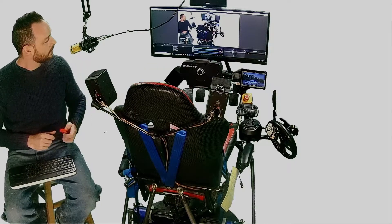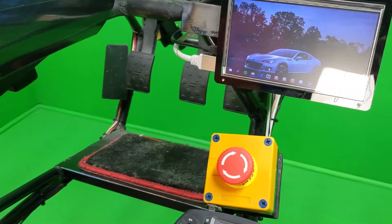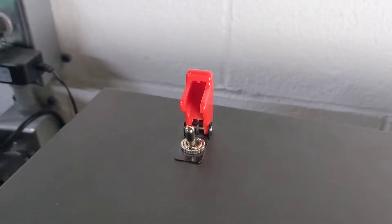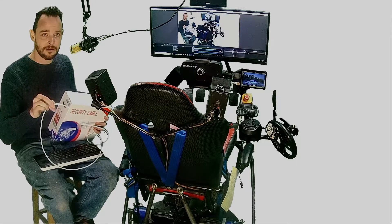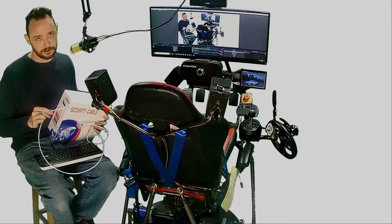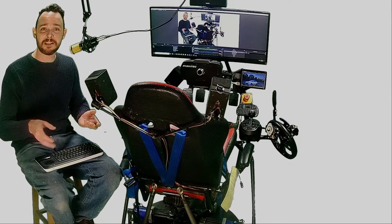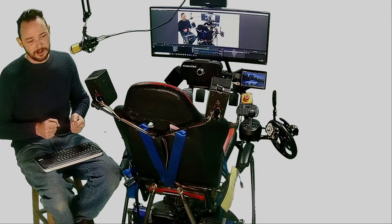My intention is to put it right to the left of that secondary monitor. I will be utilizing this 22-gauge four-strand security cable from the chassis to the existing rocker relay in series, so that either of the switches will kill the relay controlling all of the AC servos. The cable run is going to be approximately 25 feet long, go through around 50 to 70 zip ties, and take about one to two hours to perform. Let's begin!